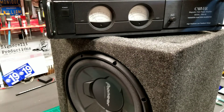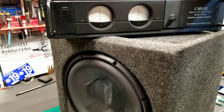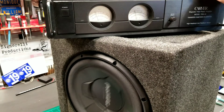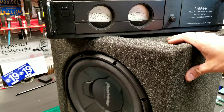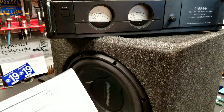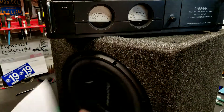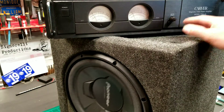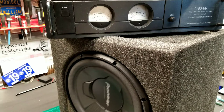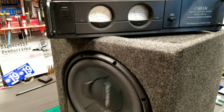At about 200 watts is where I start hearing the mechanical limits of the driver. That's also based on the enclosure - looks like a little over a cubic foot of airspace. I didn't even check my Vas, so keep in mind all these tests vary with enclosure and power supply. I would say that's the equivalent of my older driver, and this is a 39-dollar woofer, so pretty impressive.